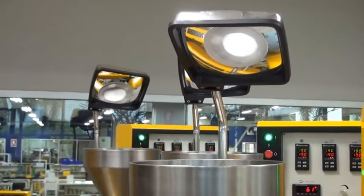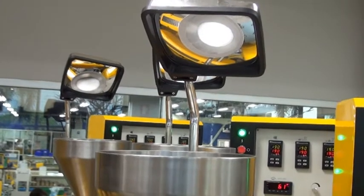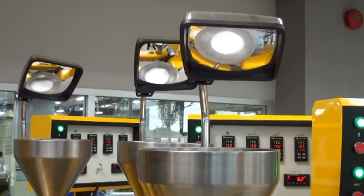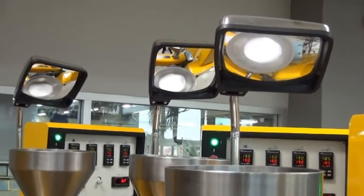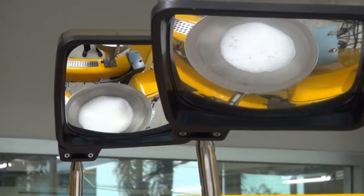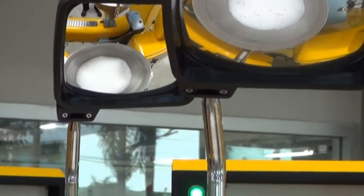Now for this bottle we are running, we are using HDPE for all 3 layers, and we use red master batch for the 2 outer layers, and the inner layer has a white master batch, so we can distinguish the layers on the bottles. And with this you can see how well the layers distribute.